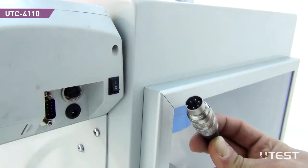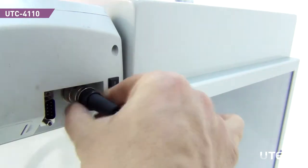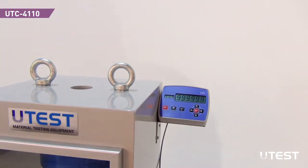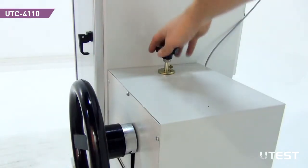Check the connection cable between the LPI and the hydraulic power pack, and open the LPI by using the switch button behind it. Turn the valve all the way in the clockwise direction.